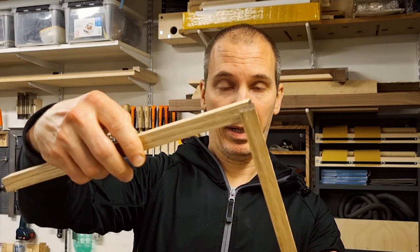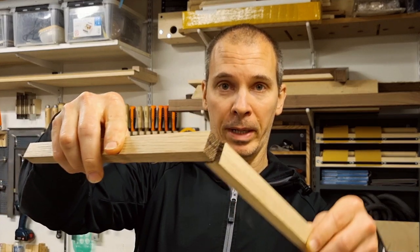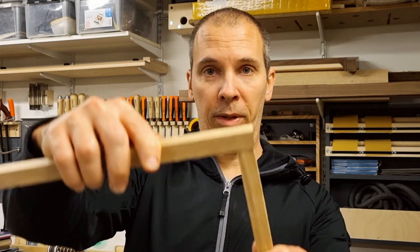If I was only making this tabletop with four edge bandings to track, I might number them and try to grain-match the corners. But this is a much bigger project, so it would be too much work. They come from the same piece of wood and will color-match very well even if not grain-matched. Also, using butt joint corners as I do here, you won't get a perfect grain match in the corners anyway.